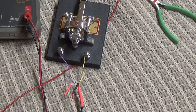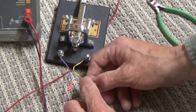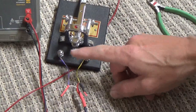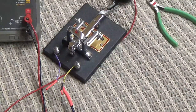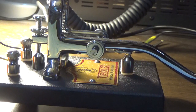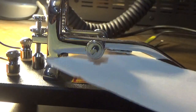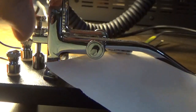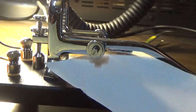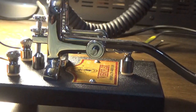All right, there's my connection. What I did — I took a little heat shrink and ran some wires. I heat-shrunk over the shield, and then I've got the white wire goes here. So basically I've got a little bit more steady connection. I'll probably put some kind of cable tie or something. So we'll take it over to the radio and see what it does. Next I was going to show you how I'm going to set my gap. I found this little 3x5 index card. I'm going to slide it in here — it's loose right now — and I'm just going to tighten this down just a little bit. It's really snug right there. I'm going to go ahead and secure this little knurl nut. I think that will probably give me what I need — that's a good starting point.